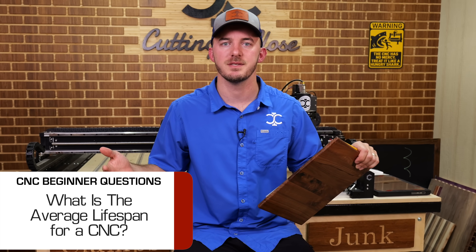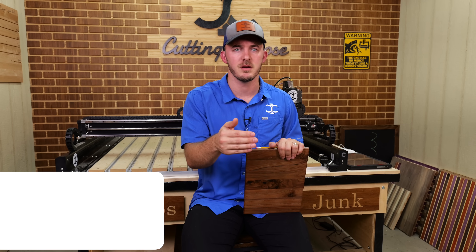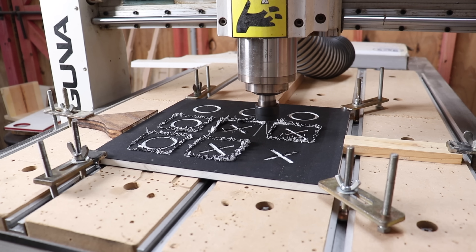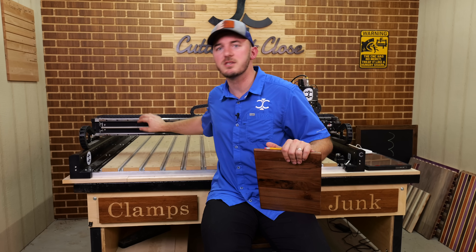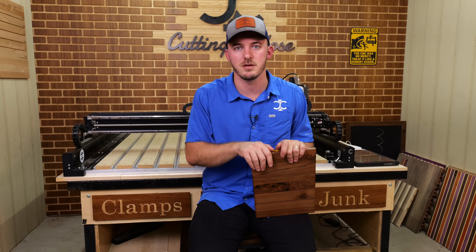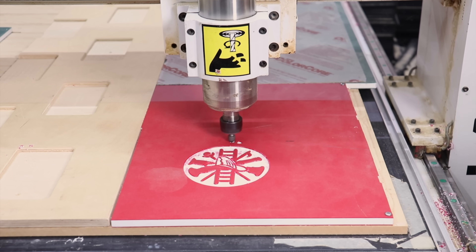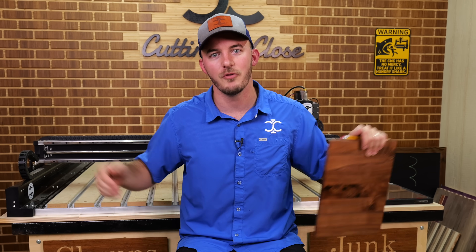What's the average lifespan of a CNC? I've been in CNC for 11 years. I still have my original CNC and it's still working — the only thing I've ever changed is the spindle after about five years. If you take good care of it, keep away the dust, grease it regularly, and don't put it in extreme conditions, you can expect 10-plus years. I also have four other machines that are five-plus years old and still going strong. Spend a little more upfront and you'll get that longevity on the back end.